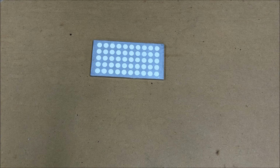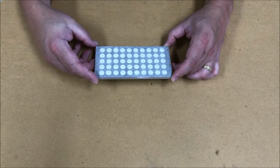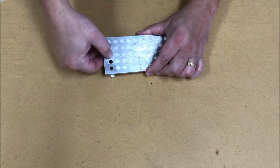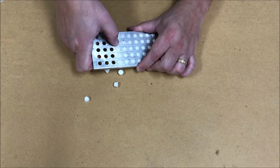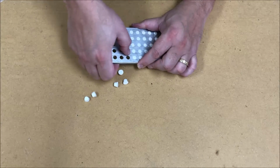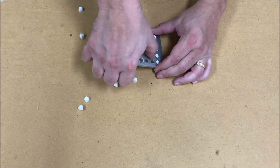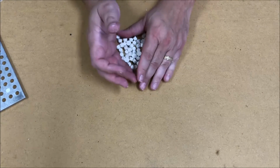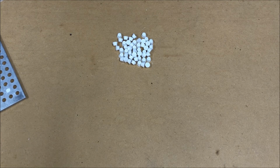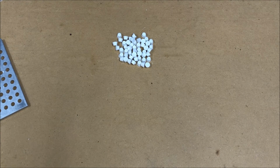Okay, we finished baking our Sculpey plugs in the Noe Bullet Moulds plug plate. That's N-O-E. So just 275 degrees for 15 minutes, and these guys come out just like a rock. And so very easy to remove the plugs from the plate. You just flip the plate over and push them out the front. And just like that, we've got 50 clay plugs for the Noe Bullet Moulds Enfield bullet.